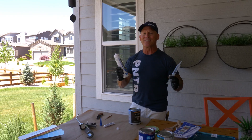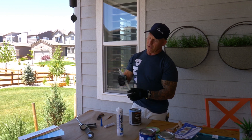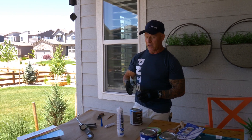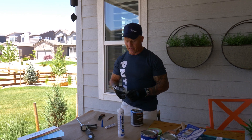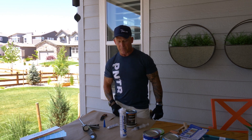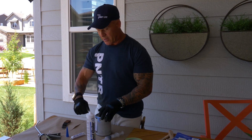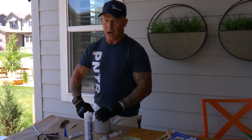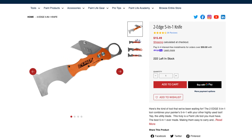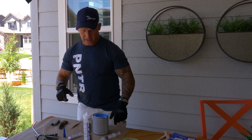You can also add stain to this and match stains or even metallic finishes. If you're using a stain, only use 10 to 15 milliliters because it's very thin and watery. I recommend — as a professional painter or do-it-yourselfer — always carry a five-in-one tool with you. A two-edged knife is great because it's a five-in-one and has a knife so you can cut the top off the paint can.